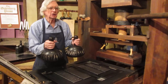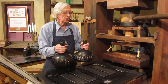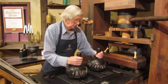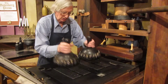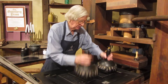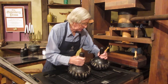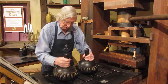Now we have to come straight down with the ink balls to get the ink just on the tops of those letters. If we went sideways, it would smear off onto the edges and wouldn't fill the letters in. So coming straight down, we begin to apply the ink to the tops of those letters. The person that did this became known as the beater. It took a little practice and skill because we have to get a little ink on every letter, and we can't get too much on a letter because that would just fill it in.